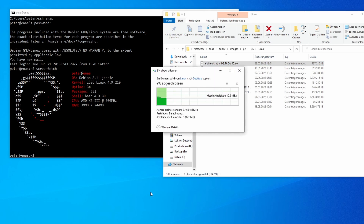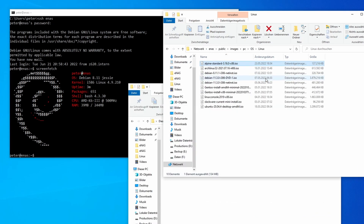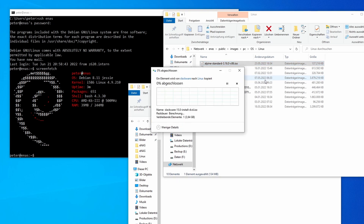Transferring a file from the NAS we reach about 10 MB per second, which is okay for a 100 megabit network card but only barely usable these days. When trying to write to the NAS it becomes apparent that something is wrong with its network connection, as we are only getting transfer speeds of less than 1 MB per second. This problem occurred some time ago and I haven't been able to find a reason for it so far, but fixing the 100 megabit connection wasn't really going to do it for me anyway. If I want to keep this NAS running for daily use, some major improvements in throughput and data integrity are necessary.